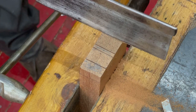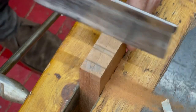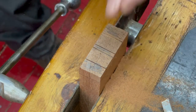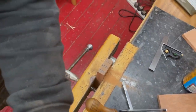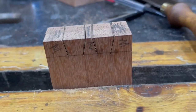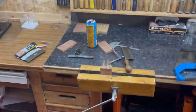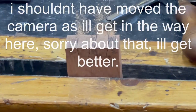just adjust that. And you got a 10 degree again, but there, and off we go. And there we go for the main cuts. The main cuts there are pretty much on. Alright, acceptable. These ones are alright, these ones you can be off. It's really when you go to make the pins that they go into, they need to be really precise if you're wanting a tight fit.